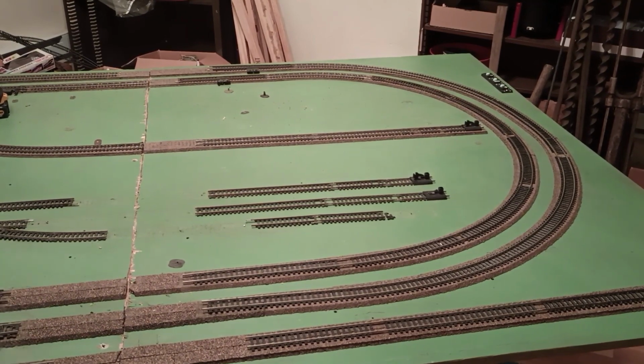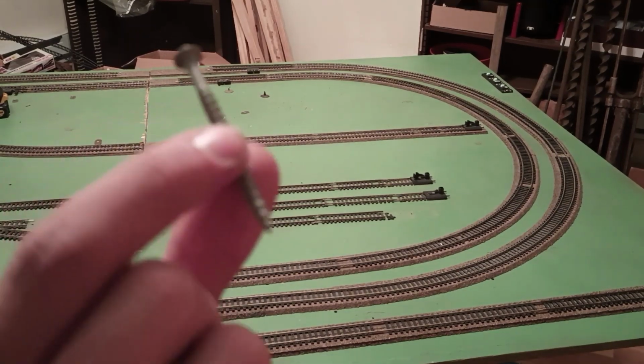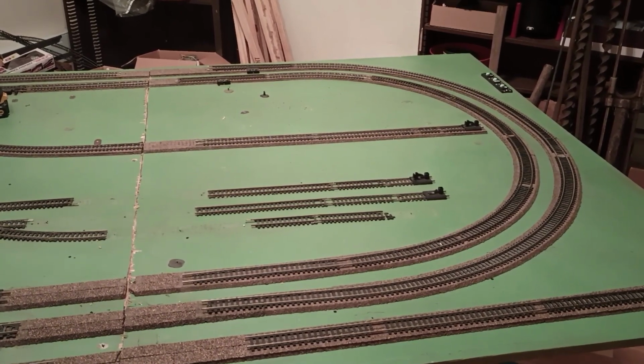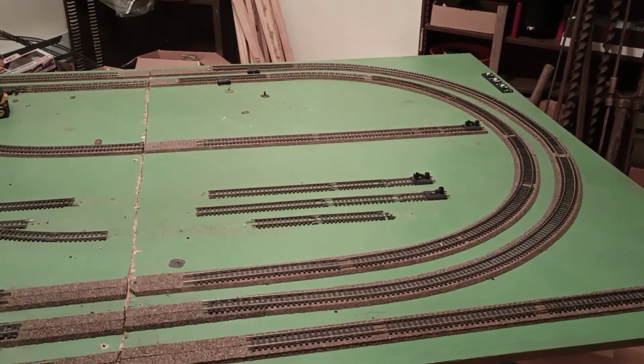And last, make sure you use the right length of screw. I see a lot of people use screws that aren't long enough. I tend to want to go for a screw that might be slightly longer than you might need. I'm going with 2.5-inch screws. I mean, you figure through the plywood you're going through 1/2 inch, so that's giving you 2 inches down into the wood, basically, down into the frame, that makes sure it's nice and solid for you. So that's just kind of my advice when doing this. Let's go ahead and get this last section lined up.